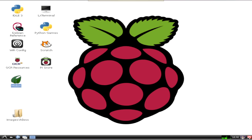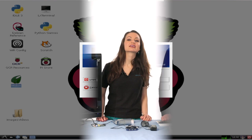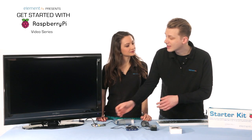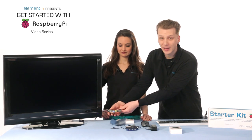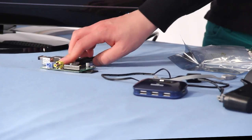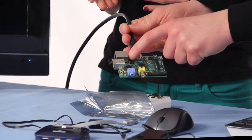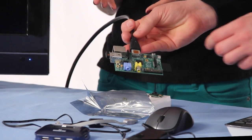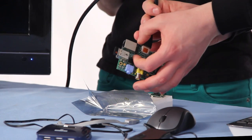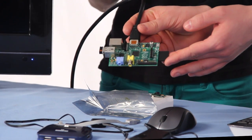I'm moving over to the bottom right-hand corner with the mouse and I'm going to click the shutdown button. I'm going to let the Pi power down. When the Pi is powered down, the best bet is to unplug the power cable so we can boot it back up later. The Pi has a camera connector — it's that little black item between the USB ports and the HDMI port. If you press it with your finger and thumb on either side of the black connector and gently pull up, you'll open it. It doesn't come completely off, it just opens up.